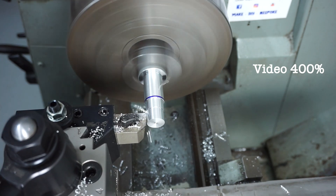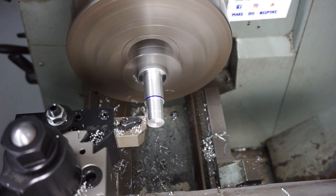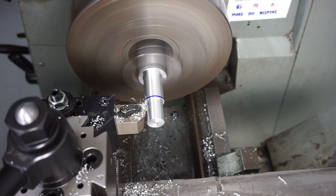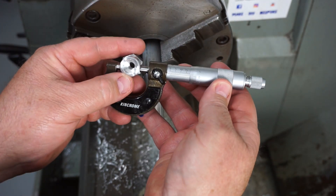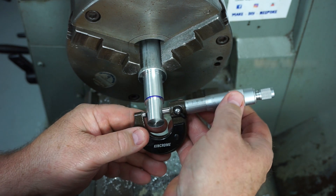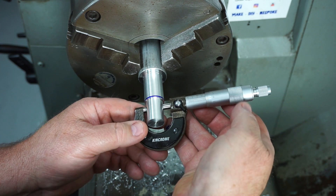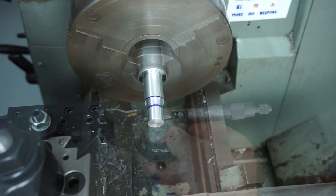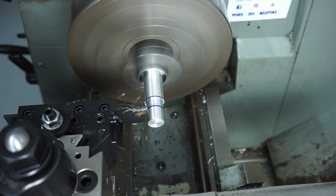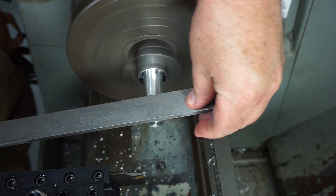I need to turn this down to a diameter of 18.5 millimeters - a bit of a weird size, but it has to slip inside that injection-moulded weed whacker housing. Comparing to the original part, which measured 18.45mm - they give you four of these and not one was consistent, anywhere between 18.4 and 18.5. With my micrometer I'm right on the money. Now coming in with a parting blade to put that little retention groove in, which captures it once you push it inside the housing.